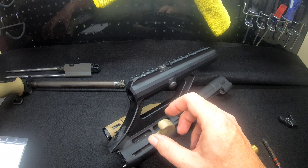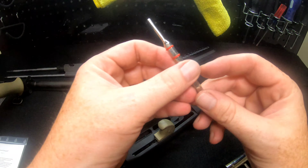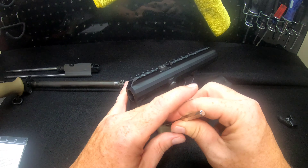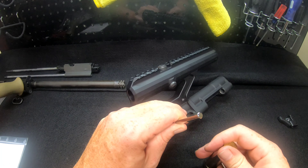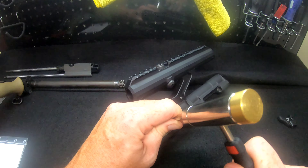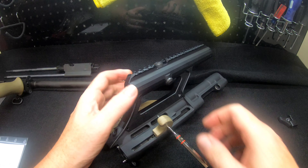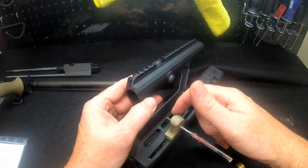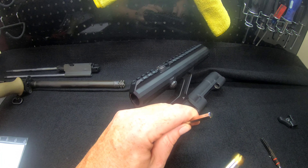I'm going to change up and go to a just a little bit larger punch — switching out to a 1/8" — so I don't ding up the drift pin. Just barely the 1/8" will go in. Since it's starting to get through I don't want to roll the edge of the drift pin. The drift pin at the angle I have it is actually going through the slot on the inside of the receiver, so I don't have to worry about damaging the aluminum.